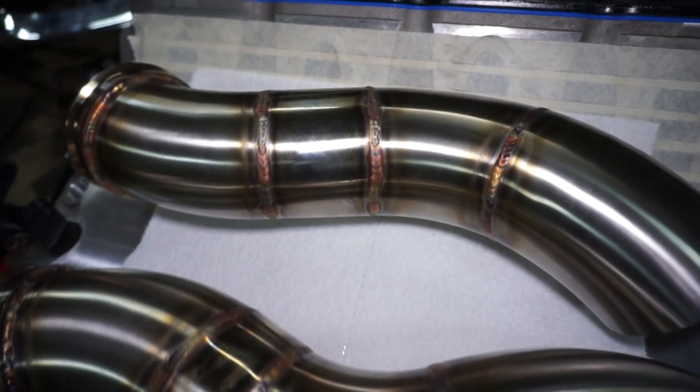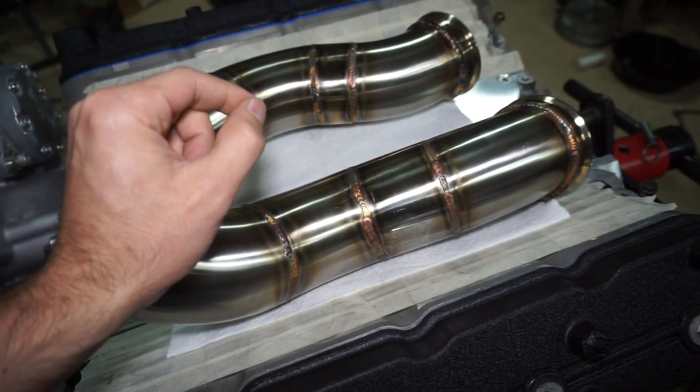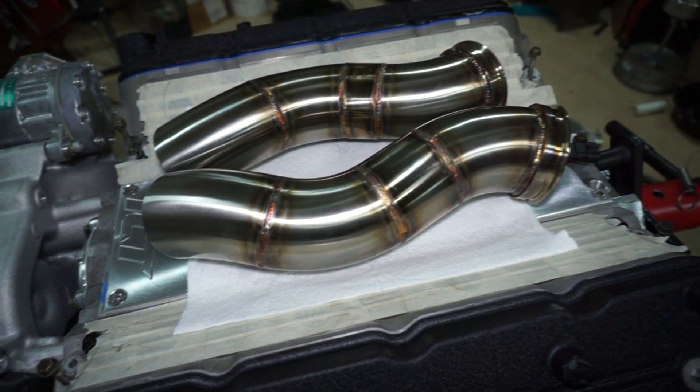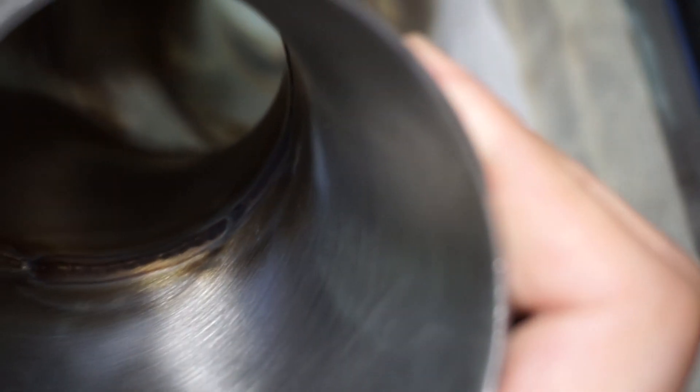Here are both pieces together and finished. You can see there's a little bit of inconsistency at some of the stops — the starting and stopping wasn't really great, and there's kind of a booger on that one. On the back side I noticed it comes up and down, up and then down, and I think my issue there is that as I'm propping my hand and coming around, I'm actually making an arc while I'm advancing. Overall not too bad, but I like to review and see what I could do to improve. The starts and stops on the V-band look a lot better than on the pipe — I have a technique for that that works pretty well, I just wasn't very effective on the pipe joints. The back side of the weld looks really good — nice and white in color, so I got a good purge and good gas coverage on the back side.